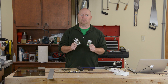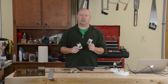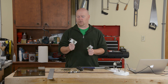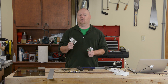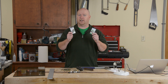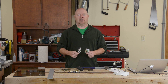What these are are the two commonly available flavors of grinding stone that you can get for a Dremel tool. In my left hand is the good old aluminum oxide stone, which is cheap and readily available everywhere, but ostensibly is pretty much limited to grinding on steel. In my right hand is a silicon carbide stone, which is at least twice as expensive, but supposedly has the ability to grind on things that are both harder, like ceramic and glass, and softer, like aluminum and brass. So I'm going to stick both of these brand new under the microscope and show you what the grain structures look like, then use them both to grind on these various materials and see what the aftermath looks like up close.